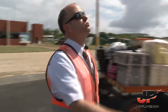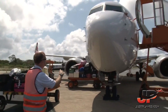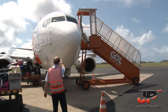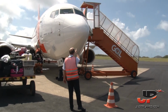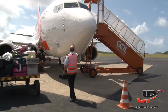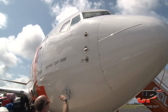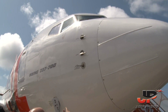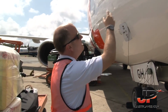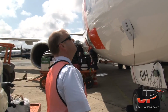Just go to the radome to see if it's all right, because it's important. It's going to be okay because it's a different material from the whole part of the aircraft, because all the radiation from the radar comes from out of that point, so this is important. The same there. The pitots, the alpha vane has to be unobstructed, or sometimes the aircraft gets parked for a long time. Sometimes some insects can get in and stuff like that. All the covers, if the flight gets waiting for too long.